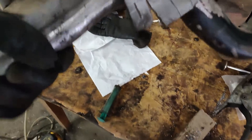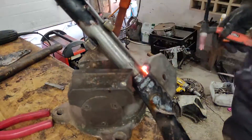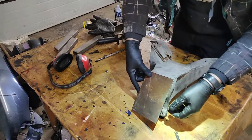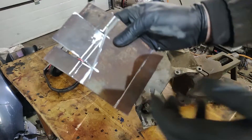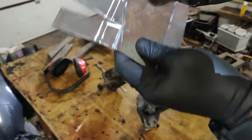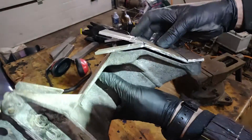Got this plate adapted — I want to fabricate the hinge on this plate and then shape it. I made two cuts: 15-degree angle here, 90 degrees here, 90 degrees here. Looking like that now, and it's fitting in perfectly.